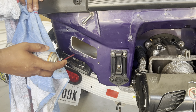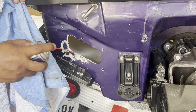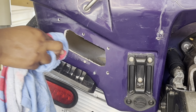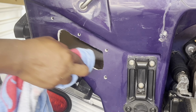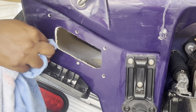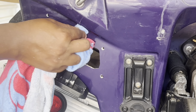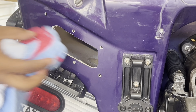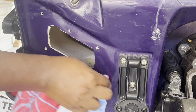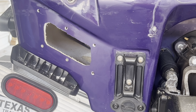As you see we got a little sticker residue here. I use WD-40 on these ST3 hulls — it doesn't mess them up. Spray it with a little bit of WD-40, let it sit for a second, then scrub it right off. If you put Goo Gone or some other stuff on here, sometimes it'll bubble up your finish. WD-40 knocks off your sticker residue — if you ever want to take your warning stickers off, use WD-40, don't use anything more potent or you'll bubble up that nice finish. The sticker residue is gone — with one pass and a little bit of rubbing it comes right out.